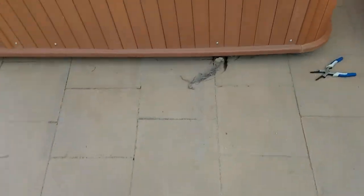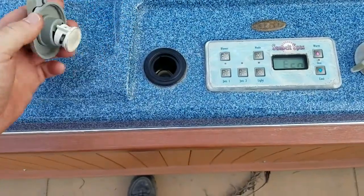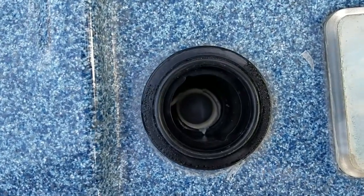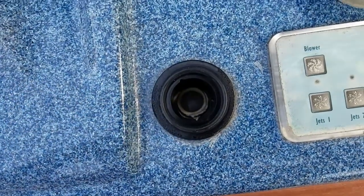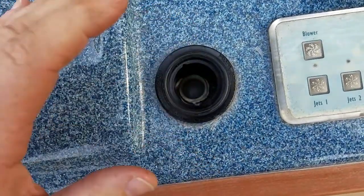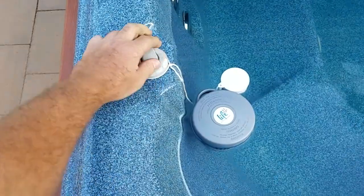When you take this off and remove the cover, this is the switch. If you look down in mine, you can see there's a lot of goop and the seal is basically gone around here, and that's why I'm losing a lot of force in the jacuzzi. The valves are just closing and not opening and closing properly. So I'm going through and changing each one of them. This one over here is for the waterfall — it barely even turns, so there's a lot of problems.